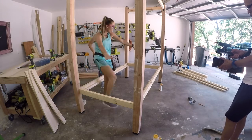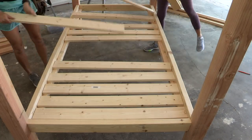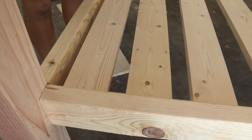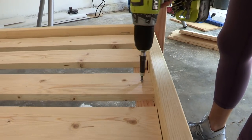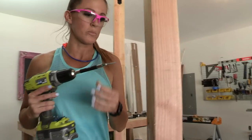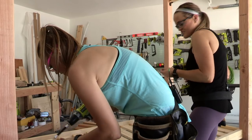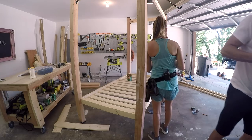We've got the whole frame assembled. Now we're going to attach all the slats using wood glue and outdoor screws. We're putting one on each end right into the cleat, then evenly spacing the rest out and attaching them with 1.25 inch wood screws. For finishing, I'm going to stain it and then put a Thompson Water Seal on it — they've got a spray that is awesome and easy to use. I used that on a planter and it still looks new years later, and on my outdoor lounge chairs the color is still perfect.